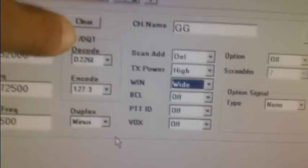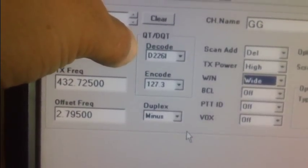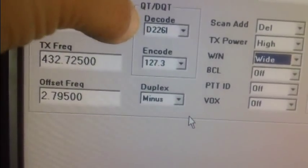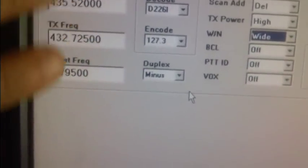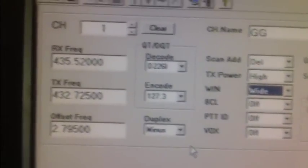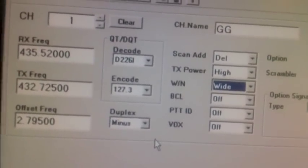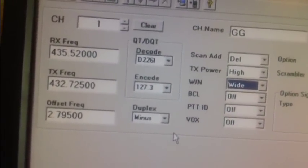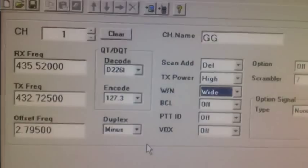Same thing with having access to the repeater. Like I said, almost 99% of all the bubble pack radios do not have digital coded squelch capabilities. And then on top of that, instead of going normal, I went inverted as well. So that's two different settings for the same number. That would knock out, I would say, 85% of the knuckleheads out there if they're persistent in having access to my portable repeater. Hams and maybe radio geeks like myself are capable, but by that time I would know if somebody's snooping around and I'm gonna change frequency or stop operations altogether. So that's pretty much the radio setup here, quick and dirty and hopefully not too boring.